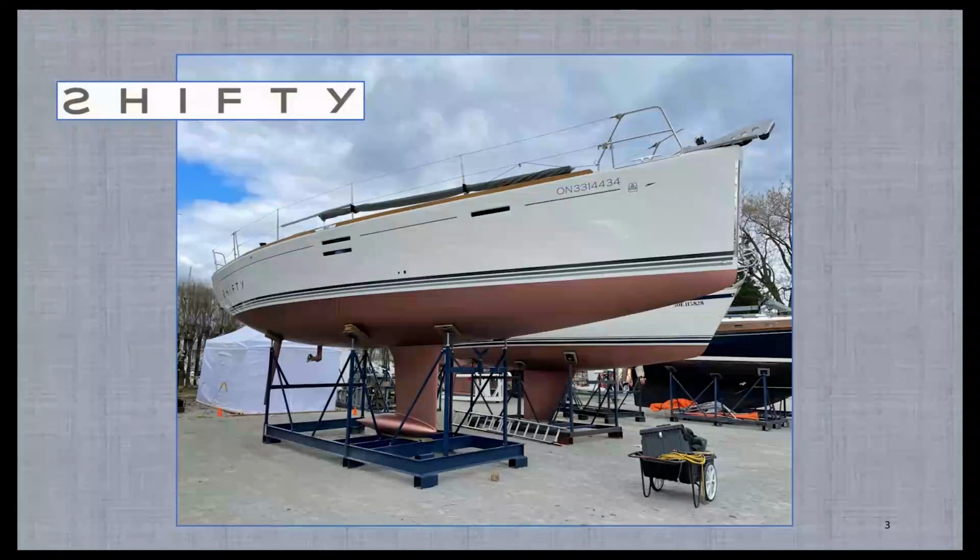This photo shows its modern design with a midships semicircular underwater hull, a plumb bow and a short stern overhang, but a beamy 3-to-1 length to beam ratio, which results in a comparatively large interior. Balancing hull shape, sail area, boat weight and keel form, these modern designs using new materials frequently feature a fin keel, often with a cast iron bulb, compared to the traditional full-length ballast keel blended into the hull.